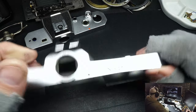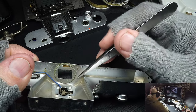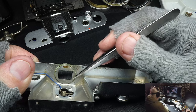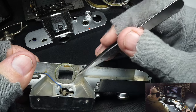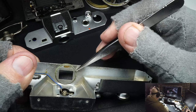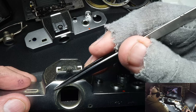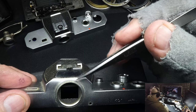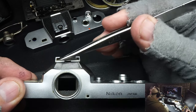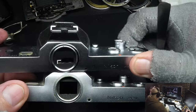It can't be fixed. The viewfinder is crimped in and I've tried using a hammer to crimp them back, but they fit loosely. The only way to fix it would be to remove the crimp with a Dremel tool and use epoxy, but I don't like doing that because I've tried to flatten it out and you simply cannot. You also have to push the flash shoe up and level it, and that's nearly impossible.